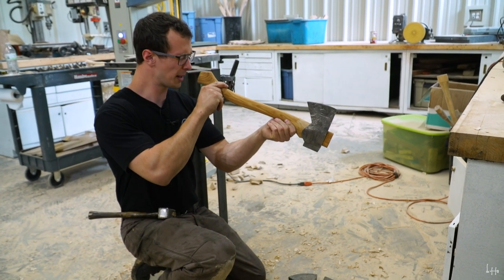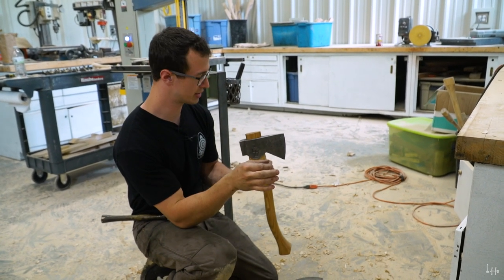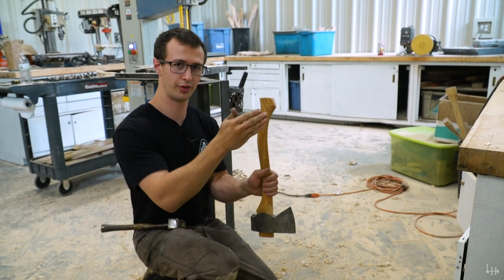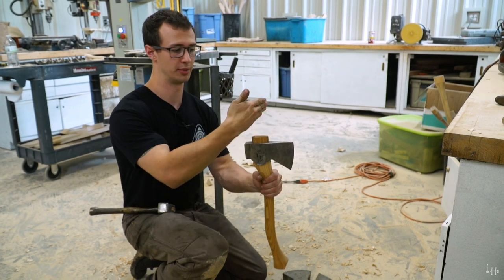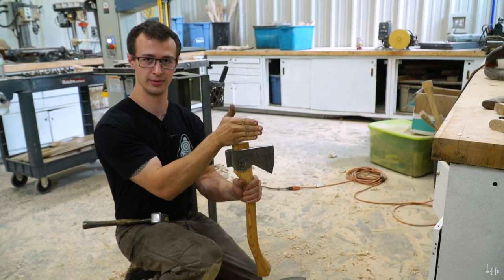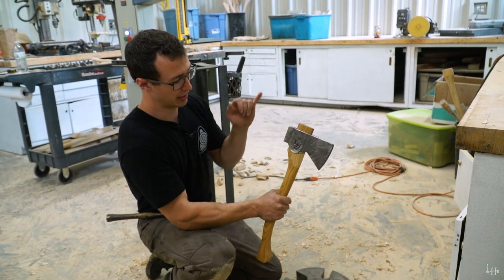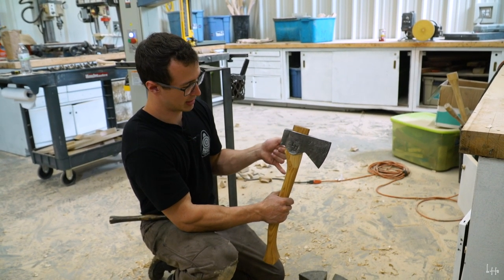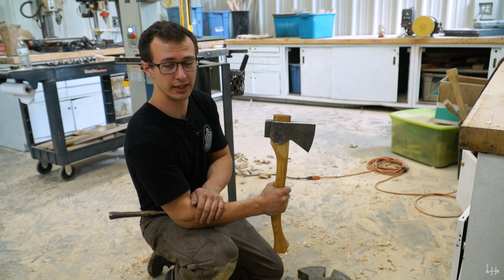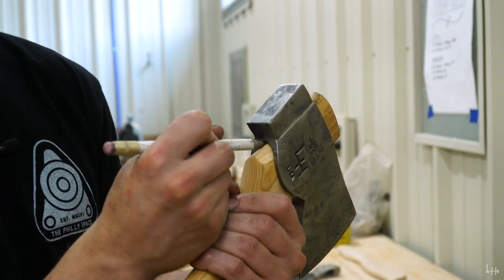We check for straightness one last time and it's straight—it kicked that axe head in just slightly and it really doesn't take much. You don't have to remove a lot of material or hit super hard to do that. As you're hammering the axe head, depending on where you hold the angle, it can move the axe head in different ways. You can also move an axe head around the handle: if you take material off two opposite corners it'll actually twist the axe head one way or the other, so you can manipulate how it fits by removing material in certain areas. We don't have any gaps around the bottom and everything looks great on the top. So we are ready to move on to the next step: cutting the kerf and getting our wedge ready. Before I take the axe head off, I'm going to put two little pencil marks—always use pencil, not marker, because marker will get absorbed into the wood. These pencil marks will help me determine where I need to stop cutting for my kerf.